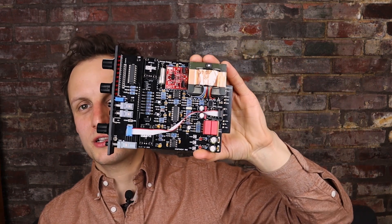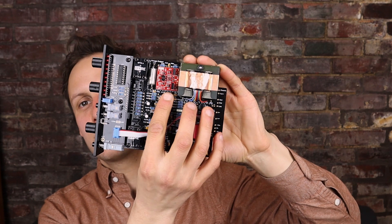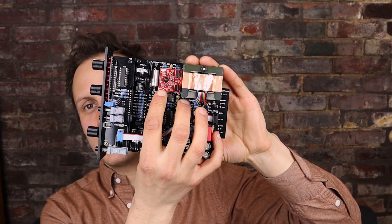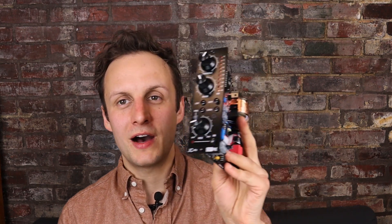But we needed to address the signal path — that's the second place where we depart from tradition. We've paired the LA4 compression circuitry with a very different tradition: the kind of American console sound. Those of you with eagle eyes will have seen the 2520-style discrete op amp here and this honking output transformer, which is custom wound for us. These are the trademarks of that punchy, mid-forward American console sound. So what you've got in the OLA5 is quite an interesting match of LA-style compression with American console vintage-style sound.